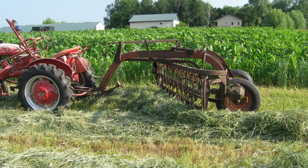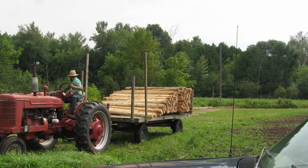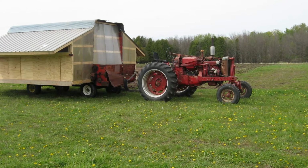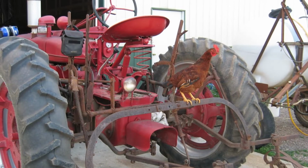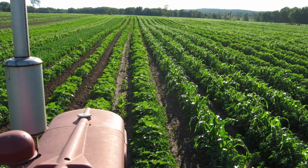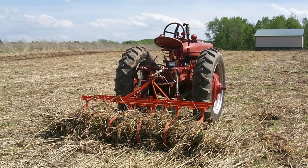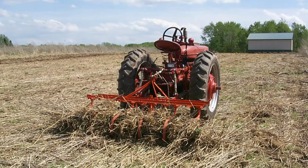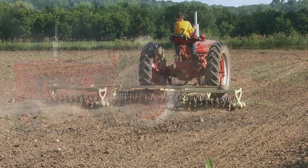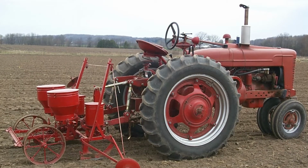There's a number of other options too. There are so many different brands of tractors out there. So I'm talking again about the older gas-powered tractors. Gas versus diesel: I've got a technical background, so I understand both very well. Gas is more from a convenience standpoint. Gas works very well for cold starting and extreme temperatures. But fuel consumption per hour is significantly more than it would be on a diesel. So diesel is more going to be for higher horsepower, not always, but for higher horsepower and better fuel economy. So those are the considerations you should give between the two engine types.